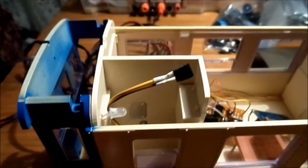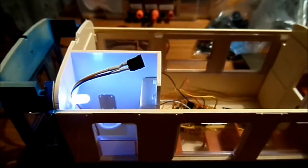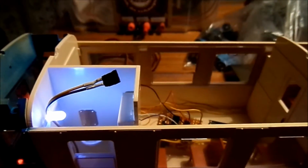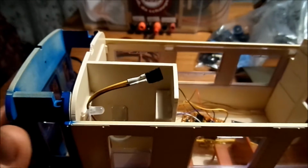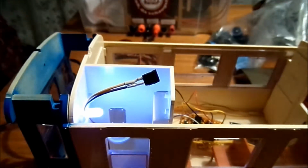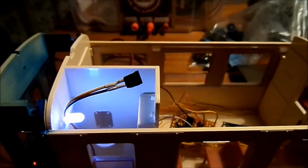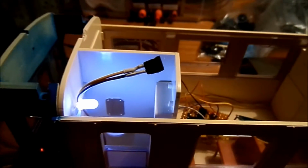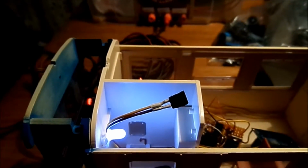And so that's it. What I found was that when I'm running the train and everything is on, the roof is on as well, the light starts to flicker. Eventually the Arduino will boot up again, and it will receive the data from the central unit, so the lights will turn on again, but it takes some time.